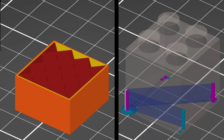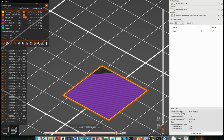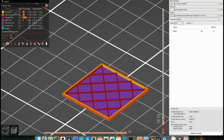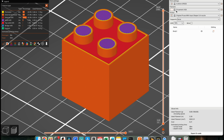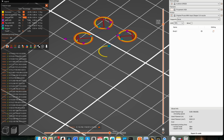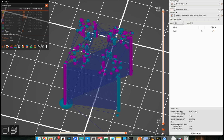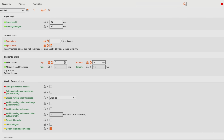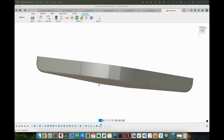And the printer is ready, but there is still one more thing that we can do to increase the speed. We can eliminate anything during the print that is not actually printing. When a printer is printing, there is time invested in travel movements and retractions because the printer prints a layer, then moves the Z-axis up, and then prints another layer. And if in a layer there are holes, walls, infill, etc., that requires a lot of retraction and empty tool movements. But there is a printing mode that we call vase mode or spiral mode that prints continuously without ever stopping. So I just need to design a kayak that can be printed in vase mode.